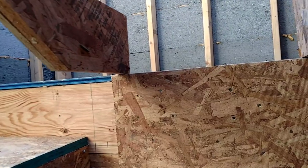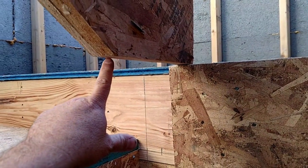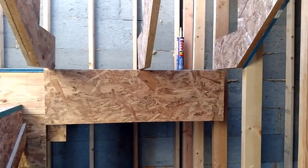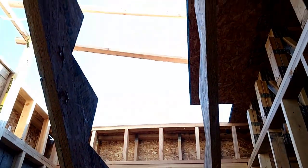This is a temporary support — the weight is not resting here. The structure is all on the back end. What we'll need to do is frame in a header board or a little wall underneath there to hold the actual support for the rest of the steps.